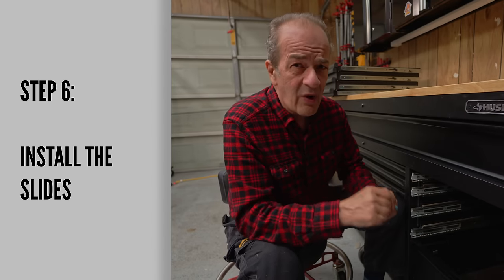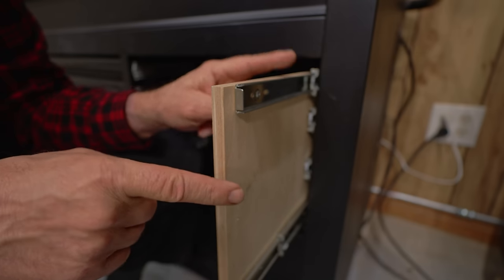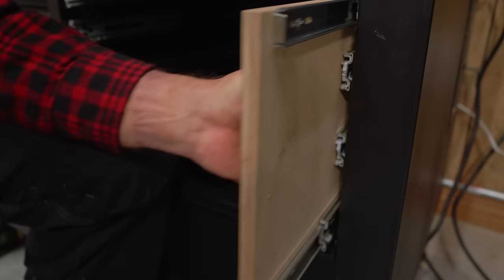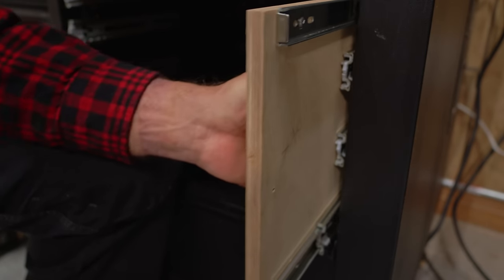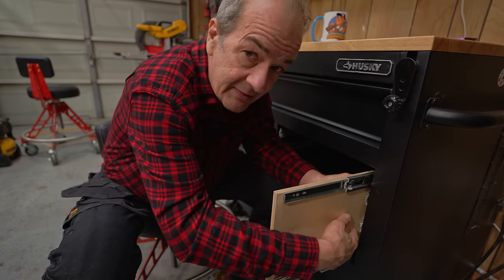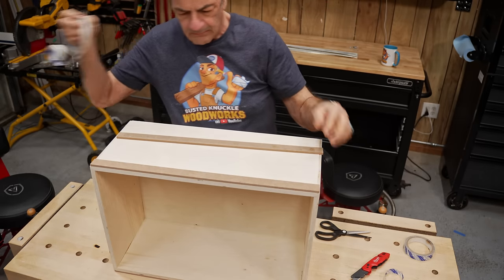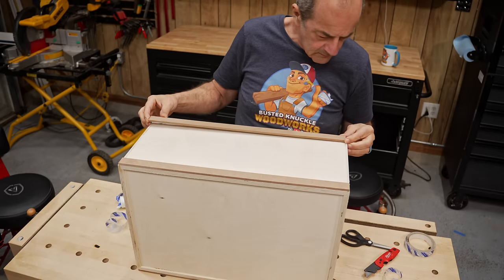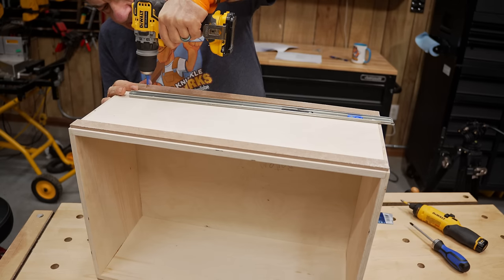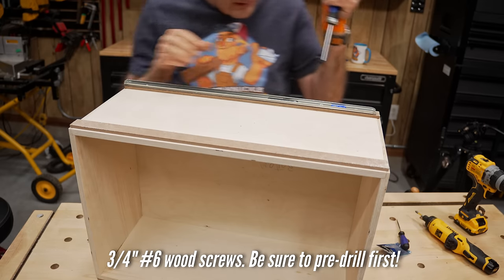Now let me show you why I made this drawer a half inch narrower than the originals. Here I've taken a piece of scrap and screwed the slides straight into it — you'll see that the two empty runners rub against the side, and that is not good. So I built my new drawer to provide a quarter inch of clearance on each side. Then I took a couple scraps of quarter-inch hardboard and cut them for shims, using double-sided tape to fasten them temporarily to the drawer and marked where the slides would go. Because of these shims, the stock screws that came with the new hardware were too short, so I replaced those with 3/4-inch number-six screws.